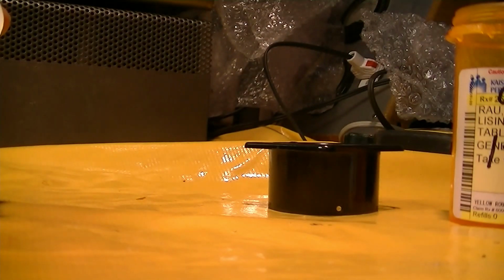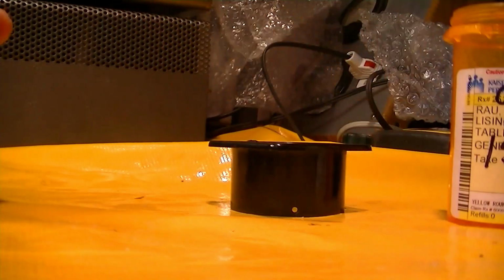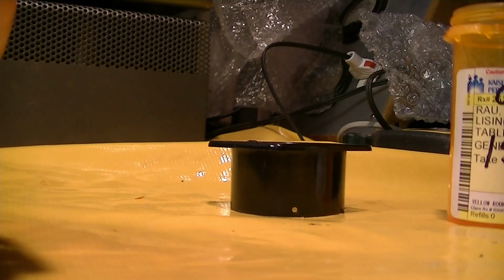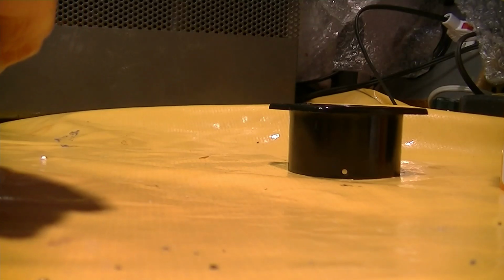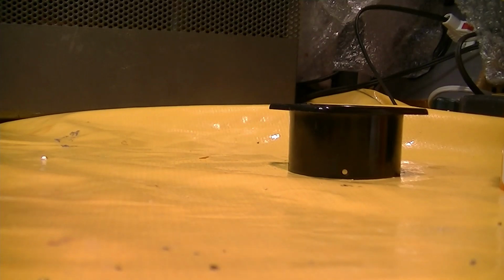The adjuster was not inserted in the adjustable part of the armature, so you couldn't adjust it when you turned it with a screwdriver. They just didn't put it back together right. So I think we've got a broken meter here, at least so far as that should be soldered on there. That's very delicate, difficult work to do.